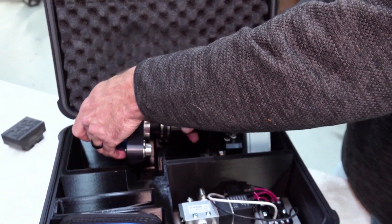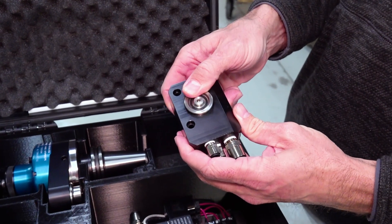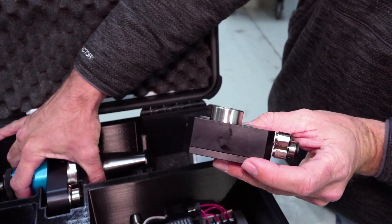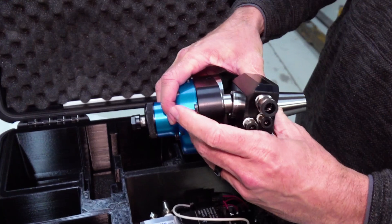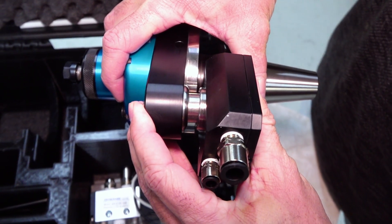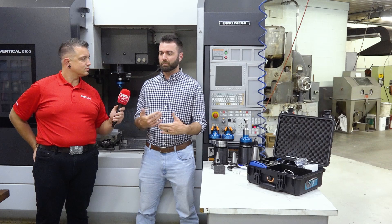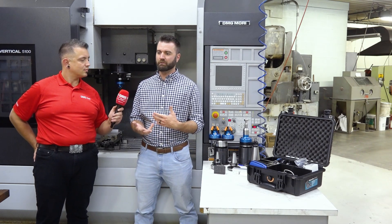Our standard machine block and air coupling is made for a Haas spindle — we have to pick some sort of standard. When you're talking about job shops with spindles that don't usually go over 12,000 RPM, there are a lot of Haases. If you go with a Kitamura, you can get 20–25K out of those almost all day. Haas does offer that option but it's not widely used, which is why we went that route. What's important to know is we can adapt these to any machine tool manufacturer — just provide a layout of your spindle nose and we can make an adapter.